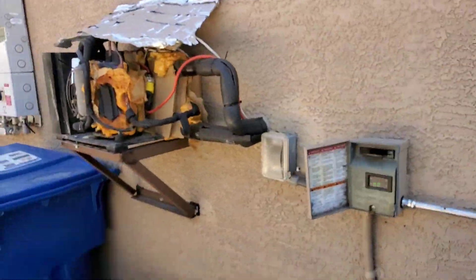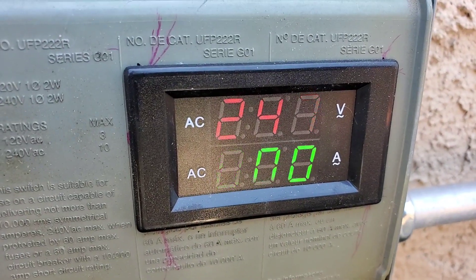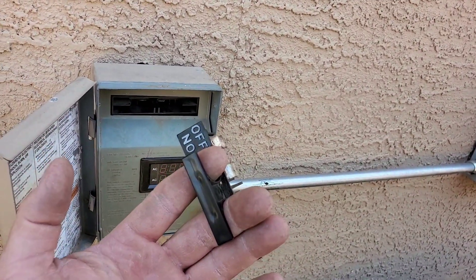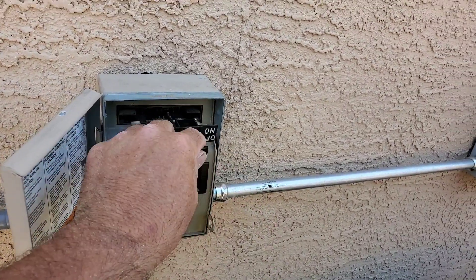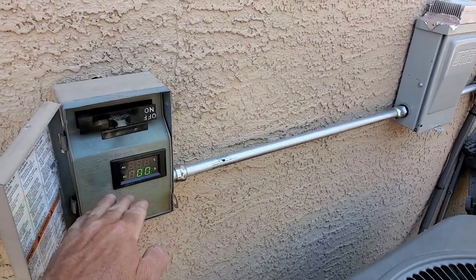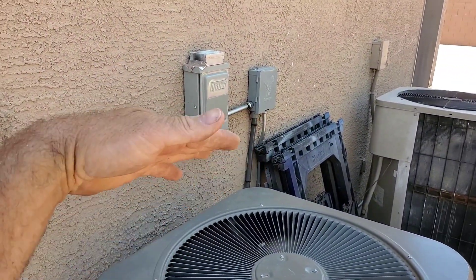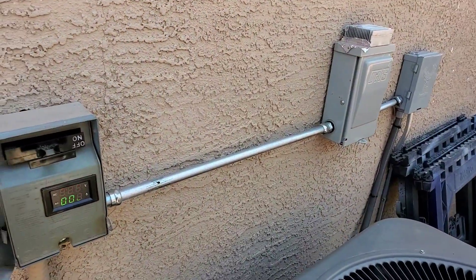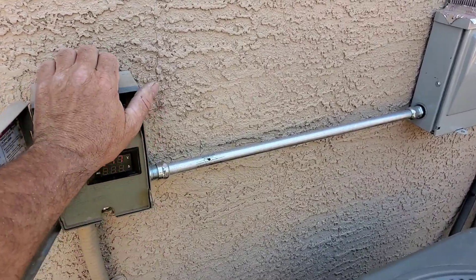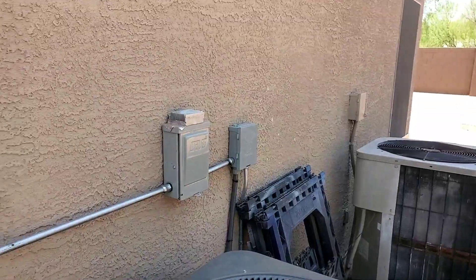There you go — eight amps. So the solar is theoretically providing three amps out of the eight, which sucks, because it can actually power every bit of it right now. Look — goes to zero. 247 volts on the grid, disconnect in my hand from the utility power — doesn't need utility power. So if I drop the utility power down low enough, at the current floating DC bus from the solar, the diodes won't even forward bias and there won't be any current drawn from the utility.